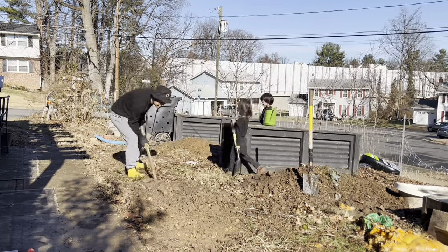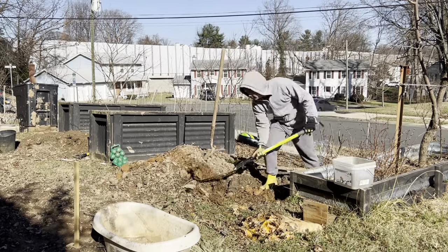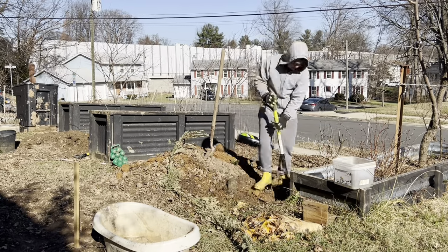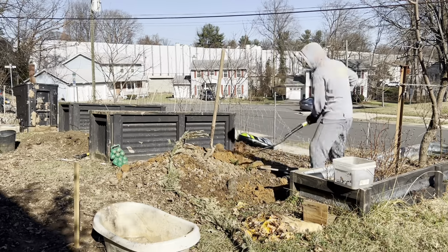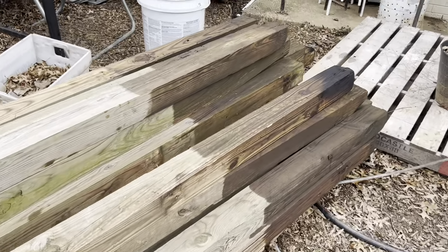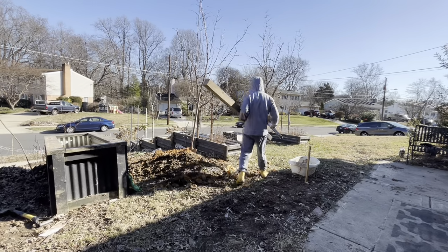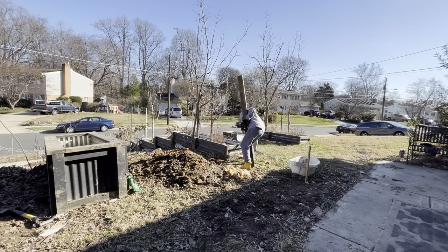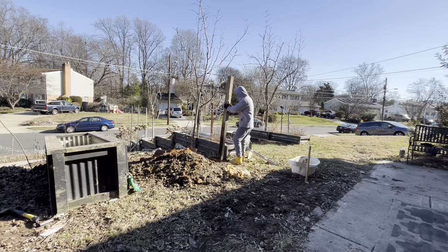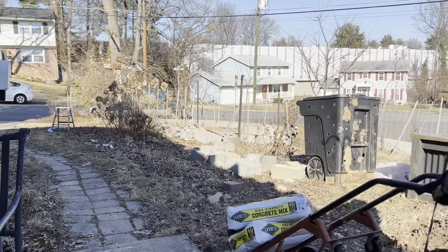My strategy here to build a fence is basically putting all the posts in for the corner edge of the perimeter, so that way I can run a straight line from one corner to another to have a better gauge. And here is the pile of wood or posts that I got before, and as you see I put some oil at the end. Basically I'm using old motor oil so that it doesn't rot, and it's going to preserve the wood a little bit longer because these are recycled posts.